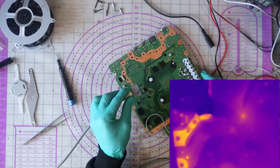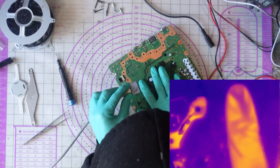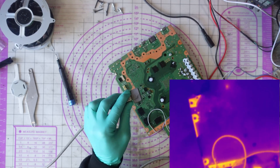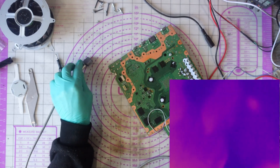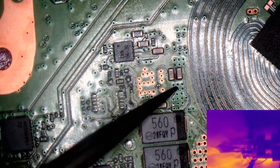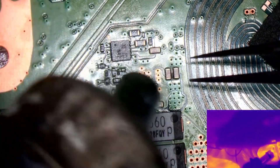Where's that MOSFET? It's over here. That's definitely got some signs of heat around here. These two caps here - let's have a look, pop under the scope. These two caps are getting warm - this area in general, definitely those two caps. I'm going to remove these. We've already had some work done in this area.